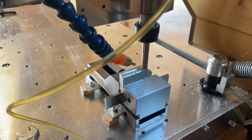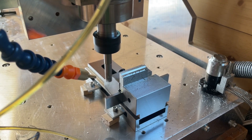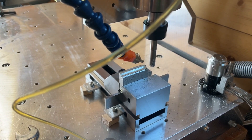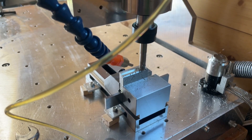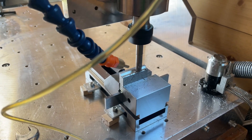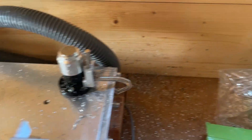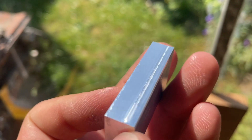Now I'm trying the other way around — a lot of radial engagement and not a lot of axial. So about 5 millimeters radial and about 0.6 millimeters in the axial direction. It sounds way better, looks way better, and I can remove like four to five times as much material in the same time with the same feed. The chips also look way better — like actual chips. I do need some covers because this makes a huge mess, but with the results I can't really argue.